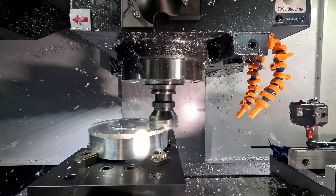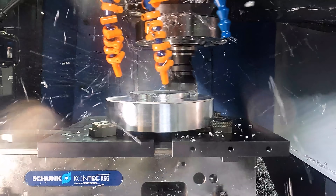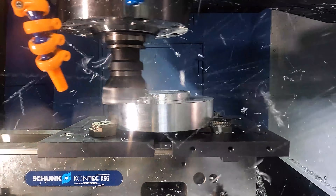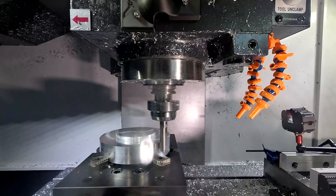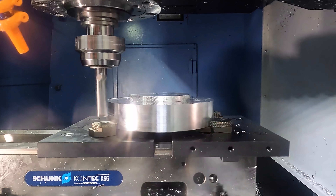The reason for that is because this bottom surface is going to locate the part on the table, and just in case there's any discrepancies between this side and the first side that we cut, we don't want to have to shim our part when we get to the five axis.